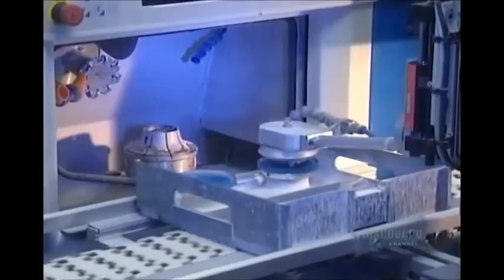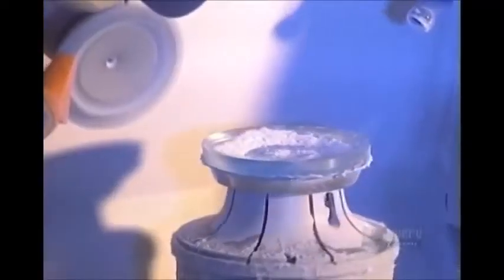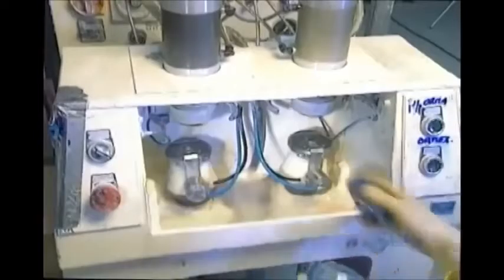At this point, robots take over. When the tray with the discs arrives, the milling machine reads the prescription information, then reshapes the plastic accordingly. First, it thins the disc and shaves it down to a smaller diameter. Then it creates the required curvature. The disc is now a lens, but you can still see the concentric circles left by the tooling and the surface of the lens is rough.